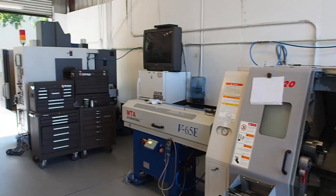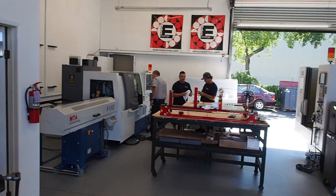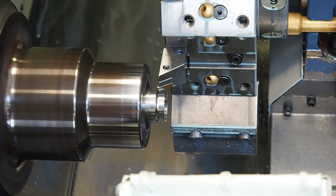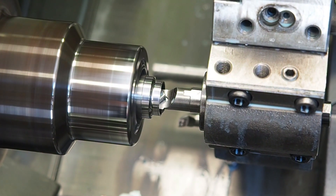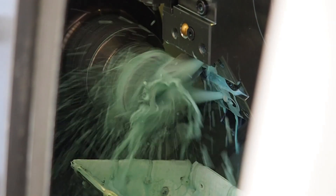Enduro receives the XD15 materials in six-meter long rods, which are then cut down to more manageable one-meter long pieces and transferred to the company's machining facility in nearby Hollister, California. Here, each inner and outer race is individually milled, along with the aluminum cups many of those bearings will be pressed into later, and even the tools required to service them.